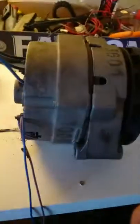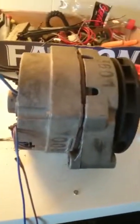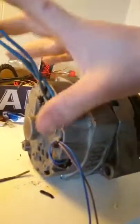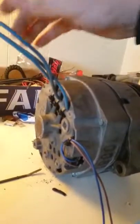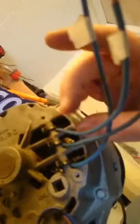This is my converter alternator, so it works as an electric motor — a brushless DC motor. What I've done is I've loosened all the screws, took it apart, took away all the diodes and everything, and just soldered cables onto the windings directly — the three cables that come out.